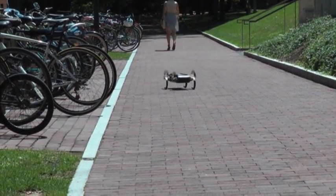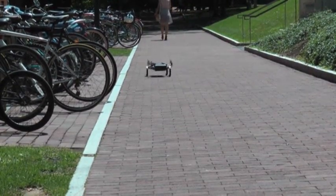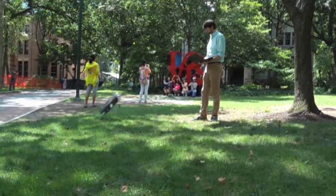And that's the same thing that you'll see insects using, because it's very stable for six-legged critters. When the robot does a backflip, the amount of power that the motors are consuming is actually much more than they're designed to do, and so we have to very carefully model the actuators, model the motors, in order to do that safely without damaging the robot.